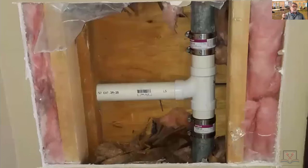That's what you're supposed to be doing. That's what was originally there in some cases. If you're looking at galvanized vents, you cannot insert PVC into steel, into cast iron. Cut a 6-inch nipple, cut a 12-inch nipple in half, have a galvanized T, do a 1.5-inch male adapter.